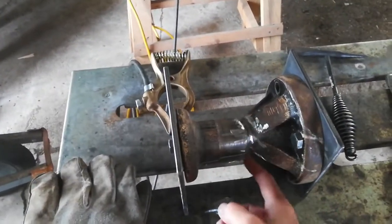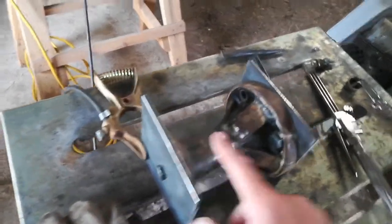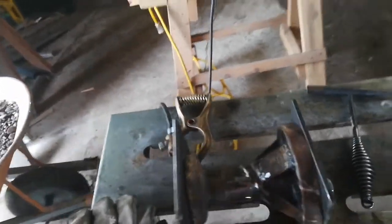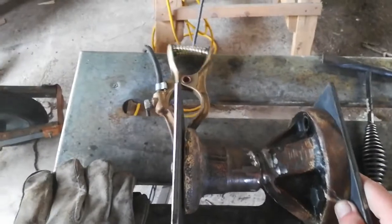The crack goes all the way through. What I did is I took two plates — there's a through bolt here that goes all the way through, and then I used these two bolts to back this plate so the whole thing is oriented properly. Then I just took a grinder and ground all the way around.